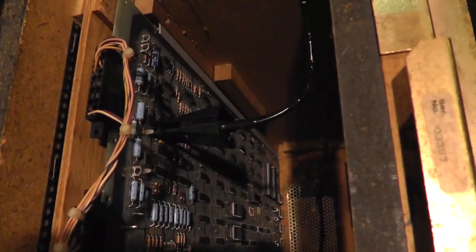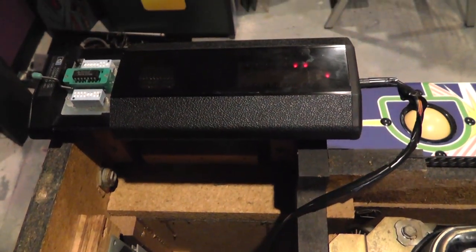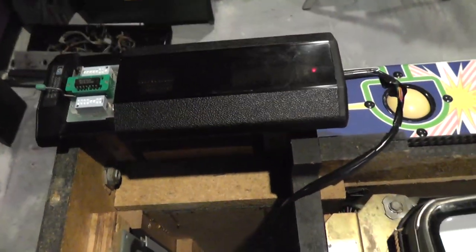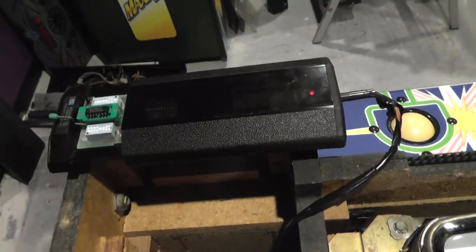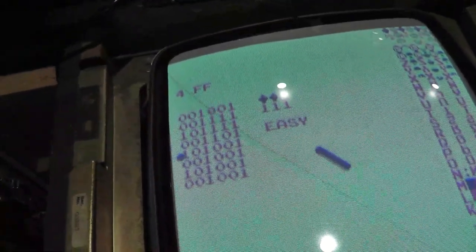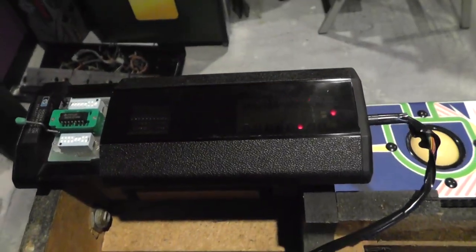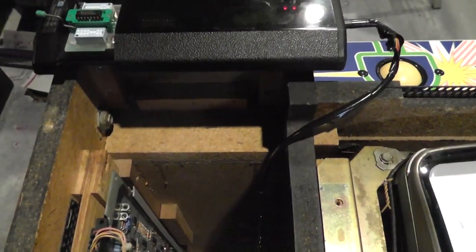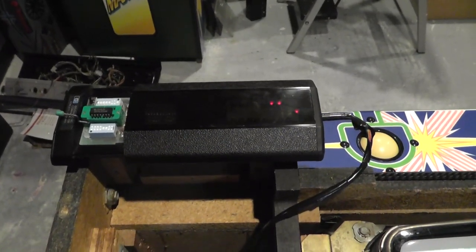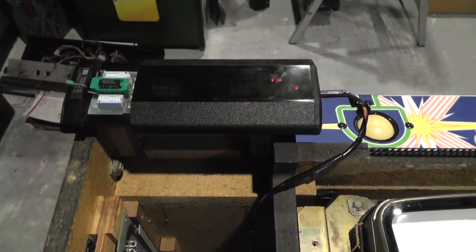All right, I have the logic comparator on the LS74, and we definitely, something does not look right. Yeah, every time I move the trackball, that LS74, I'm moving it right here, that's going crazy. Got lucky just with the location of that because I don't have a trackball on the bench. But let me pull this out and put a 74LS74 in there.